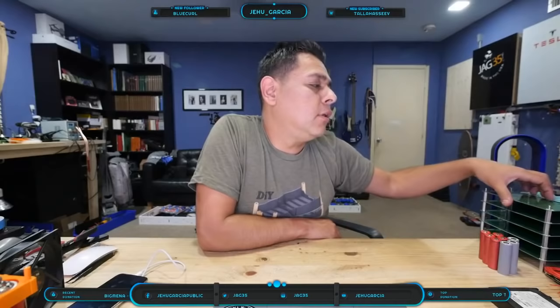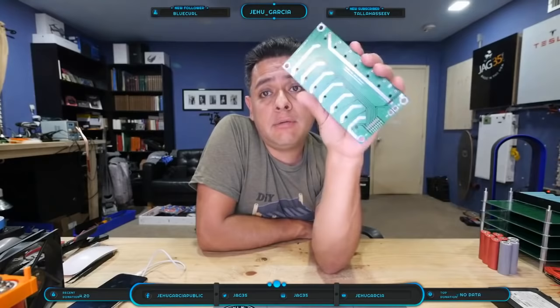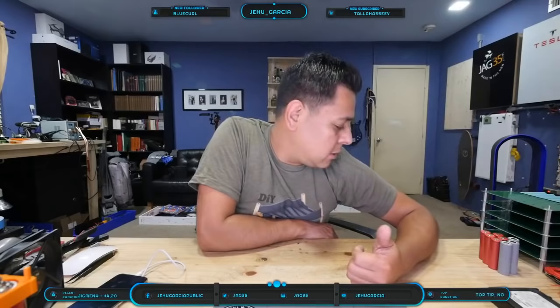Can the PCB board that you made be used for e-bikes or other EVs? Well, yes, it can, but remember, I'm designing it for a 1C or less load. That means you can only get 100 watts per board, so it's not the most efficient. It's also not the most compact, which is what you want on those vehicles because you don't have a lot of space. The energy density is not the best; it's actually kind of bulky. You'd be better off using the regular e-bike packs, which are super compact. It can be used if you design the system correctly and don't exceed the load, but those holders are just not that good. They can't do more than 4 amps per string.